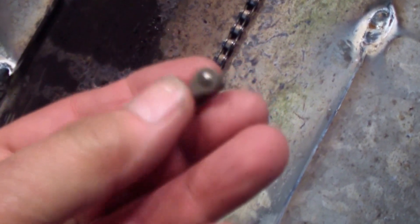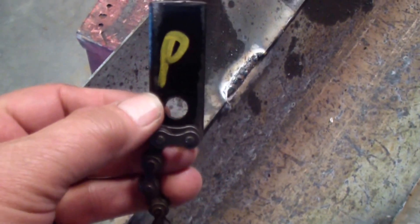I got the sides all welded up on the conveyor I'm making. Here's the chain — it's actually bicycle chain size, I guess 41 narrow. They make a 41 wide but this is a 41 narrow. This link is a 41 wide, which will work well for what I have planned. I've got plenty of this chain, which is the reason I'm using it — I got it from old garage door openers that use a chain drive.